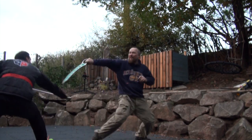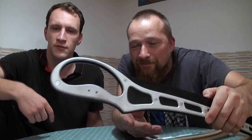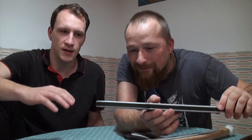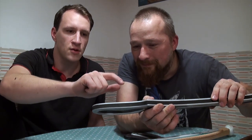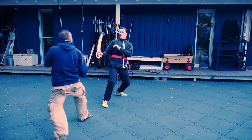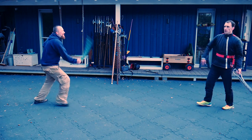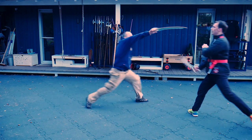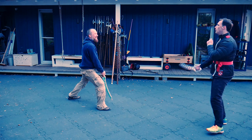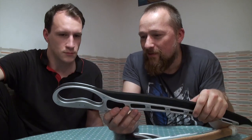Okay. I had the impression that the handle could use a little bit more meat, a little bit more thickness. But I wanted to leave people the choice to have the thickness on there or just leave it like that and maybe wrap tape around their handle. Make these dussacks yours. They are yours. Make them so they fit you. But I also wanted an option to put handle scales on the grip. And these two holes are threaded M4. So we just use the same screws that we use to hold this all together, and you can screw them in there, and then you have a thicker handle. Handle scales, I might also offer these in my shop in the future, but really, it's meant for you to do whatever you like with it. It's one more option to customize. So this can also have different colors, different materials.